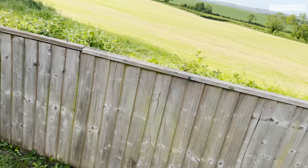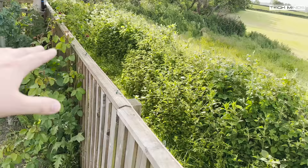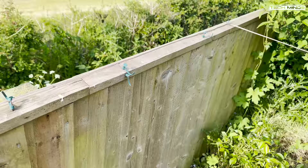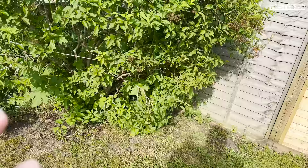This came with 41 meters of wire and that's exactly what I'm using here. In fact, I couldn't get 41 meters of wire in the air neatly with the size of my garden even if I wanted to, so this is kind of the next best thing. The wire goes from the unun across the top of the fence. Of course, if you wanted to, you could try shorter lengths of wire and just use an ATU — whether it's external or one built into your radio.